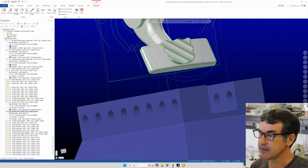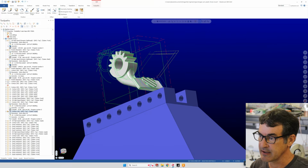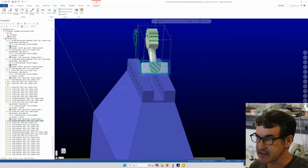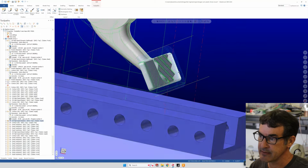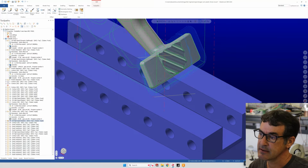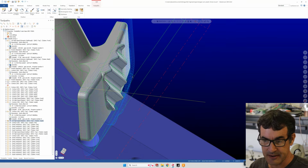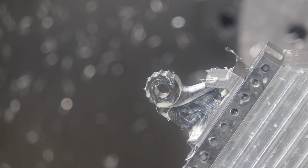You can see how the tool enters perpendicular to the angle that we defined, and that way we can profile this just like we're on a 3-axis mill with crazy fixturing like that. And using that same angled plane, I did a 3D raster profile, which starts to cut in and define at least the edges of our tooth pattern here. All right, what's next? We will now machine the face profile using this work coordinate and tool plane, which is real handy with a 5-axis, because you can set any plane that you want, basically. All right, let's keep going.